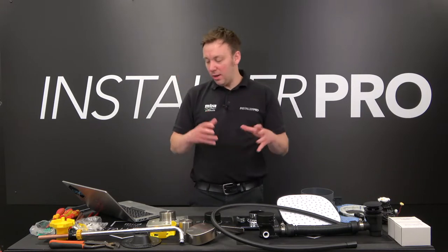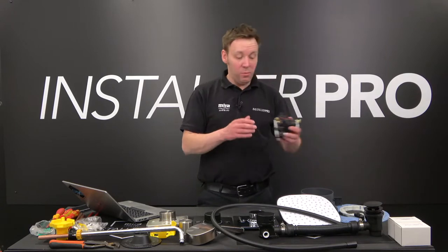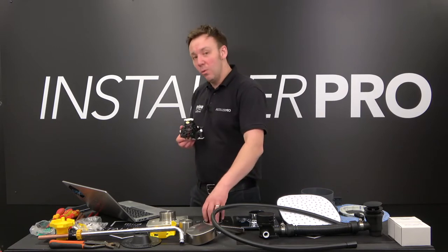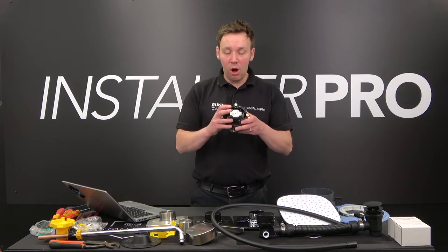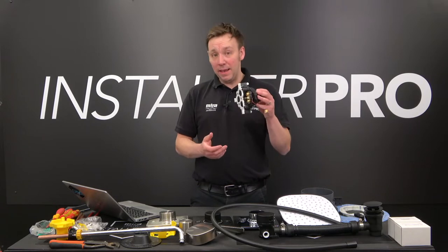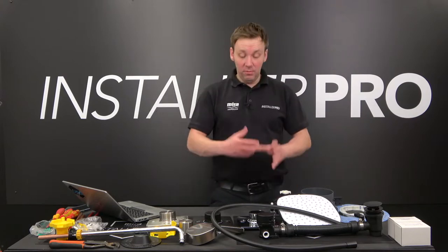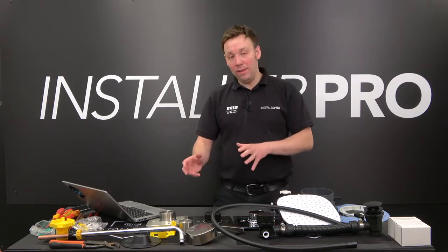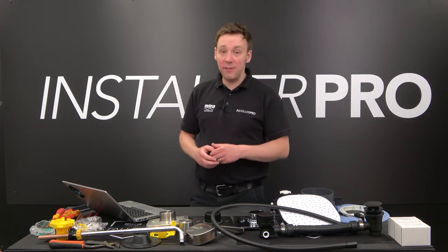How does the Hydroglow work, and is it a serviceable part? So I think I mentioned that a little bit earlier. It works through the dissimilar temperatures across the hot and the cold. It generates a small current which lights up that LED. It is a serviceable part. If it does need replacing at all, you change the cartridge. All of that Hydroglow technology is incorporated as part of that, and it can be replaced or repaired if required. And there's a brand new cartridge as well, and you get a 5-year guarantee on the shower, but any of our spares, whether that be internal components or fittings, you get a 12-month guarantee if you need to change them once the guarantee period's out.